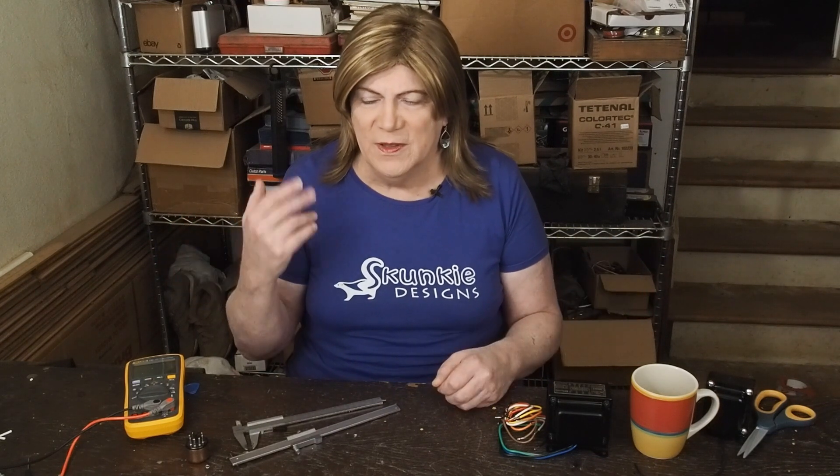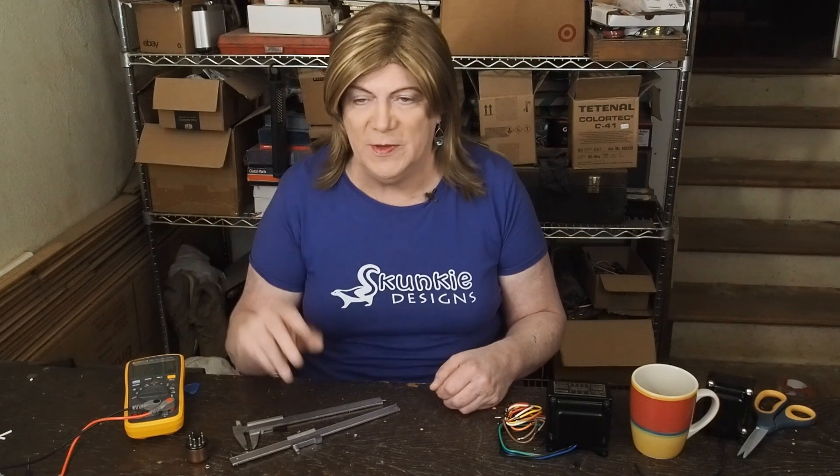Let's go over what we're going to spend doing that. You're going to spend a minimum of $100 getting a pair of good 6SL7 tubes. If you want new old stock — say some Sylvania, not even Holy Grail tubes — you're probably going to spend $150. Then you've got to replace the rectifier tube with a 5AR4, that's another $40 to $45. And these prices aren't including shipping.